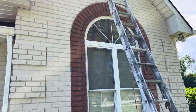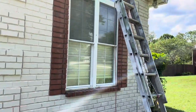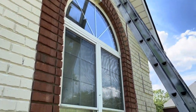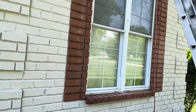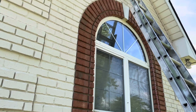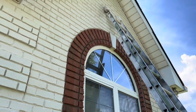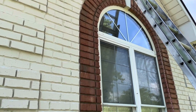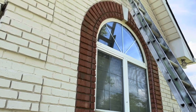So I just wet it all. The masonry paint that's on the house now is dry — that's had time to dry. So I've just gone through and wet this, pressure washed all that brick trim, the accent piece that we're going to do around the window, so it's wet. And now I've given it about five minutes to dry so that it's not dripping. Now I'm going to spray it just a light coat. I've masked off the stone up at the top so we don't get anything on that — we're going to keep it clean. And now I'm just going to spray a light, even coat of the same Roma Bio masonry flat paint on this brick.